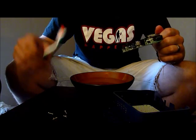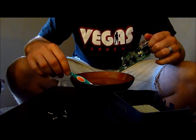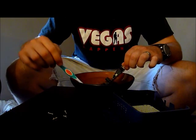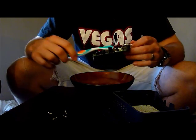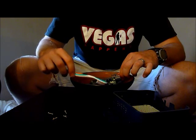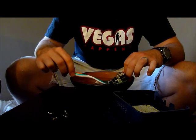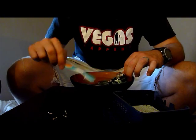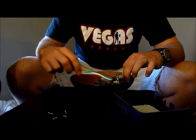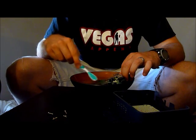To remedy that, you need isopropyl alcohol, aka rubbing alcohol, 90% or greater. I've never used anything less than 90%. If that's all you got, I'm not going to say try it, but if you're feeling lucky, go for it. All you do is very gently scrub down the circuit board. You want to get all those little feet of that microprocessor, your A to D converter, your amplifiers — you have all kinds of stuff on here. Just make sure it's nice and clean so that nothing can be short circuited.